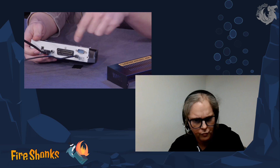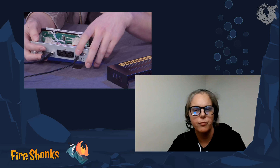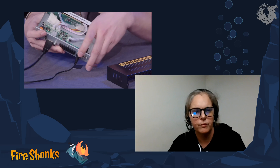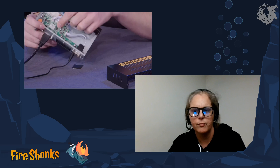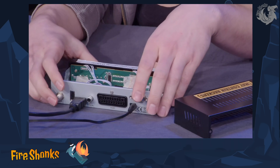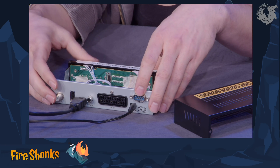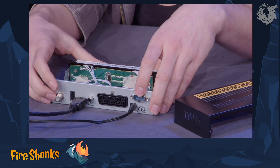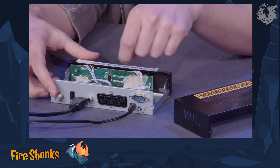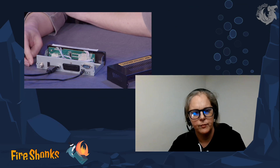Is it common to have a serial port? Not that common, actually. Quite often you have to look at the main board to find something like a serial port, and maybe it doesn't even have any. Something else useful is this flash chip — this small one here, about four by five millimeters — it's an SOIC-8 chip, and it's very good because it's rather easy to connect to with a certain kind of connector to read out the flash.